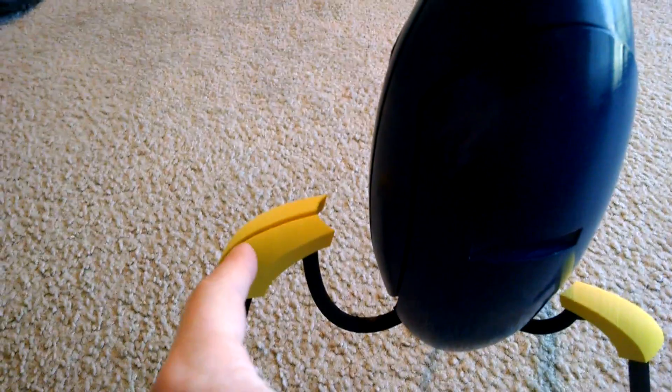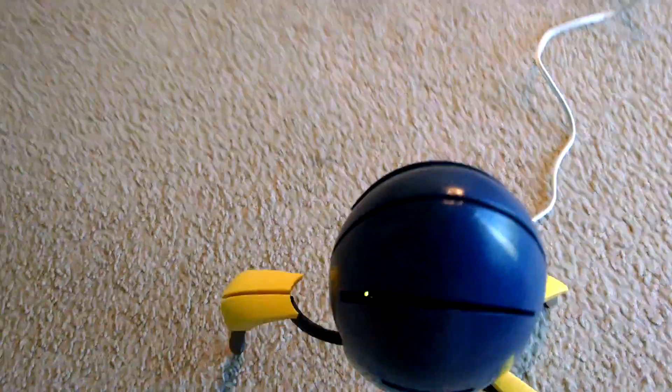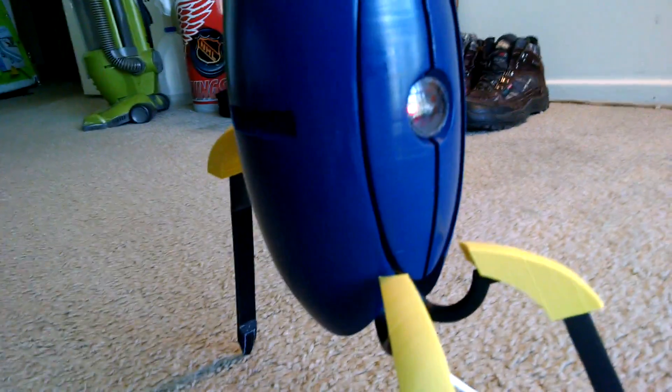I changed the shape of the rear leg elbow. When I drew this up I simply made an ellipsoid — I found some blueprints of what the portal turret looks like online and I took the dimensions for the two diameters, and I made my ellipsoid fit those two as well as the height dimension. Then to create the elbows, when I was doing the slicing based on the angles for the doors, at the bottom I just took what was left over, cut them into the three pieces for the legs, and because I had cut the slot that passes around the entire thing first, I left that in the rear elbow joint. The neat thing is that the three elbow joints perfectly make up the bottom portion of the turret.